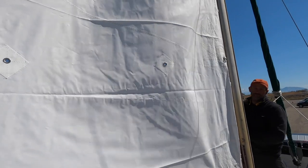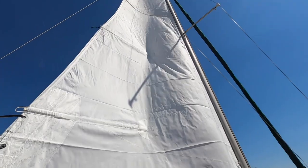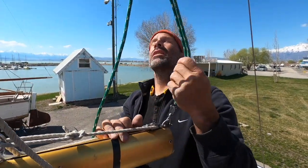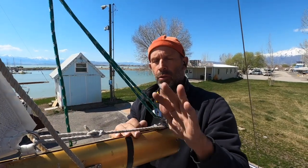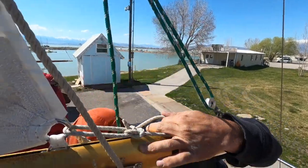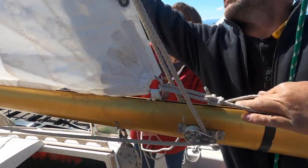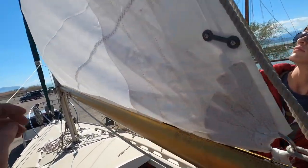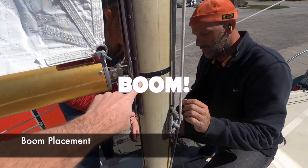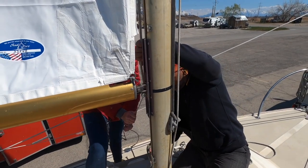There's our reef point, a one reef point on our mainsail. So we do just want this one to have some tension. Just a little, it's basically for when you drop your sail. Just the whole thing. This one to get a good shape. So right now, see if we pull this. Okay, so now look at your sail. Now watch this. We're setting our boom, even with this line here, trying to help maintain good mainsail shape.